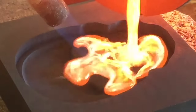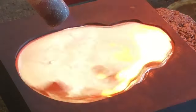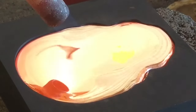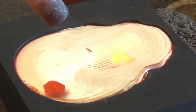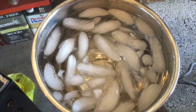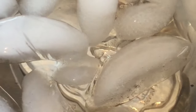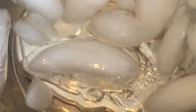Here it is — the first pour. The bunker skull. Silver is at about 1100 degrees, pouring good. Nice — I got about the capacity of this mold, could have done slightly more. Put some nice lines on that, and now let's drop that into the quenching pool.